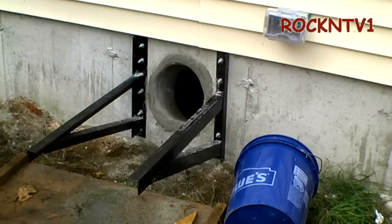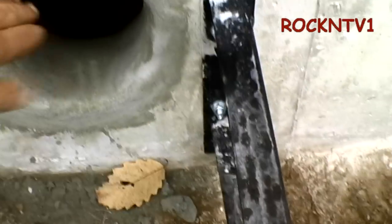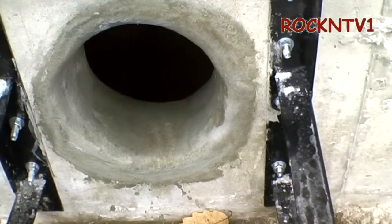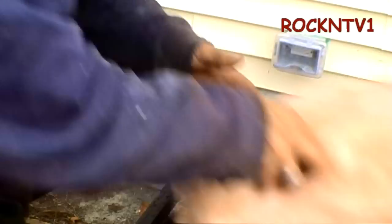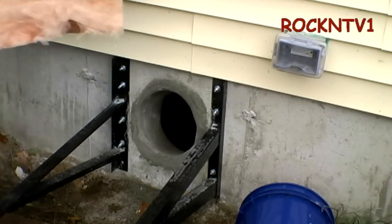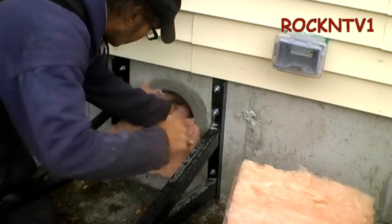I'll just let you see real quick in that hole. I just threw the meatballs of concrete in there and then smoothed it out with my hand — that's quick-setting concrete. You've got about 15 minutes to work with it. Just a thin layer of this is all I'm using, just to patch up my hole a little bit.